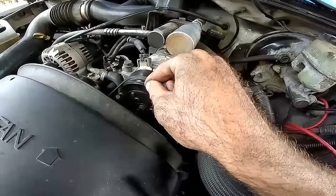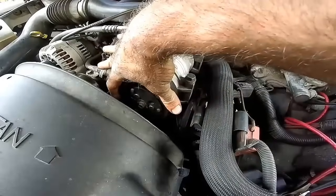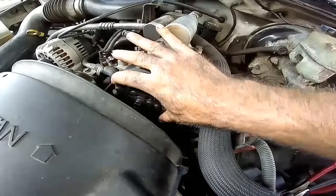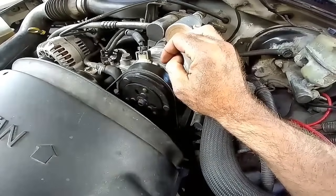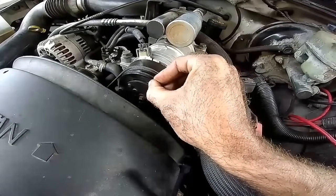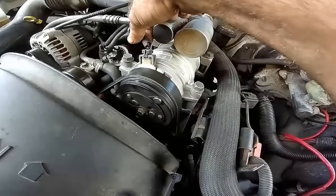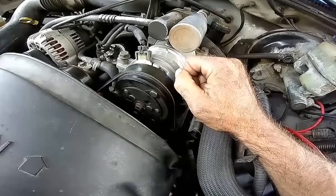The shims give you a specific gap in between here. You should be able to rotate the compressor by hand and it should have some drag — it should not spin freely or freewheel. It should be nice and smooth, with a slight gap here but not a huge gap. Check the basic condition of your wires that go to it.